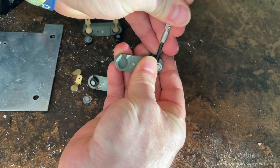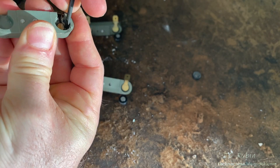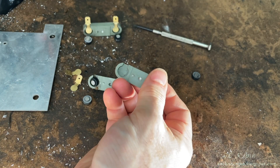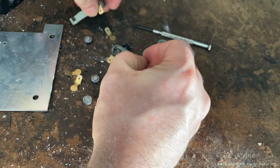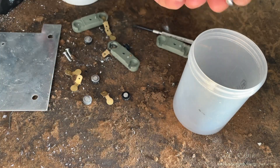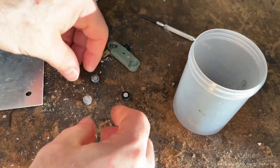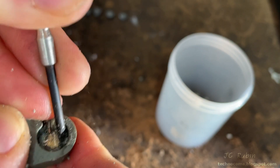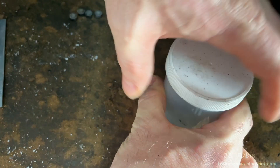Here's one that melted — I'm trying to save the plastic retainer. I was able to remove the diode, but looking inside the metal piece has melted into the plastic, so I'll have to scrape some of it away. I want to get all the springs out since they're embedded into the stuck rivets — they will be reused. I'll pull the rivets and springs from all three and drop everything into an appropriate container so nothing gets lost, keeping this quick and cheap. With patience, the last piece did come out.